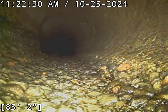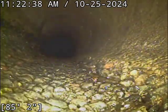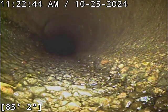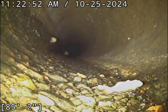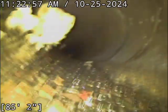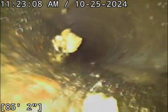You're starting to get kind of a wear line in some of these spots — it may not be super obvious to someone who doesn't look at sewer pipes all day long. You're getting some heavier wear about where the edge of the flow line typically resides. I don't see any settling issues. I don't see any strong signs that the line has opened up to the ground, but the line is definitely on the older end. It looks like you might have a crack there running across the top of the pipe — that is not a pipe joint. It appears to be a crack with some moisture seeping through it.